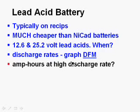So you wait 5 minutes and turn the key. Run, run, run, and it'll crank the engine some more. It might not start, but it'll certainly rotate the engine. It's because you gave it time. A lead acid battery needs some more time to get the full amp hours out of it. So you can't get all the amp hours out of it if you're discharging it at a high rate. You don't have to write this down, but it's probably going to take you about 20 minutes if you really wanted to get all the amp hours out of a lead acid battery.